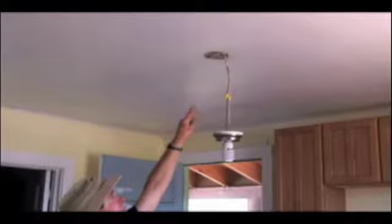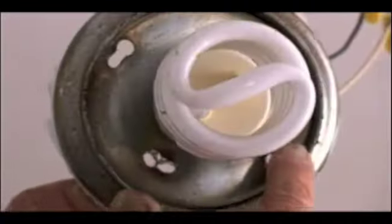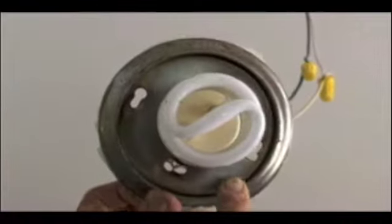In the attic here, in the sheetrock, that's about a total, almost as big around as a golf ball if you add up everything. Ordinarily, you would leave that, no big deal, and you put this light fixture back on, no big deal. The light fixture has 3 holes in it, pretty good sized holes. There's a hole around this. The light fixture won't fit tight, so it's going to leak. So pretty much it would allow all the heat up in this upper area to escape through those holes. That's a pretty big leak for heat, and then you add up the total leakage, and all of a sudden you've got a hole that big just going out straight through the attic.